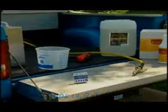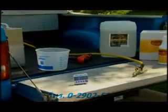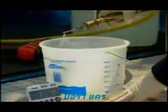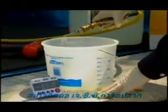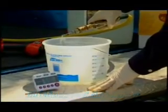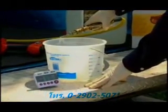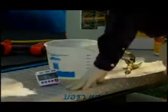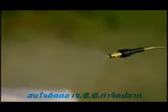Remember to clean the equipment at the end of each day. Failure to properly rinse the Boracare solution out of the equipment will not damage equipment, but may clog hoses and applicator tips. Clogged equipment can be cleaned by flushing with hot water. Cleaning clogged equipment is very time-consuming and can be avoided by daily cleaning.